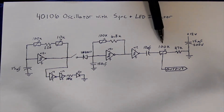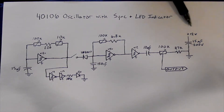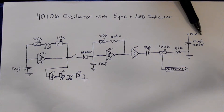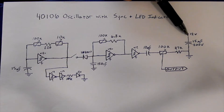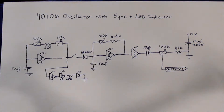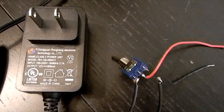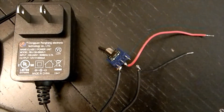So there's a 100K potentiometer, a 47K resistor here that goes to ground. And then over here we've got this right here to AC couple — basically just a big capacitor that's going to help with any sort of volume or voltage fluctuations that may occur. And that's the circuit. This is the power supply — it's just a 12 volt DC wall wart with a switch soldered in there. Just cut off the barrel plug and add that instead.